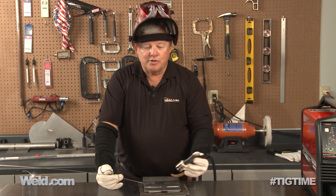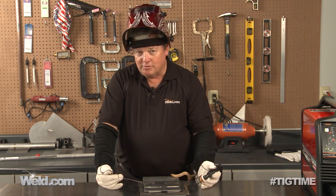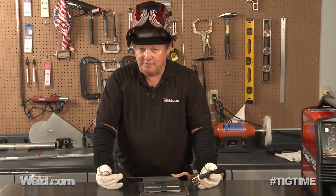What the narrower cleaning action allows you to do is get deeper penetration into the aluminum. This is just an exercise to show you how your machine can clean your aluminum for you. You don't necessarily have to do the cleaning action before welding, but I just want to show you the difference. We have several links in the description below showing different techniques and methods of welding aluminum, and we'll continue to add more. Anyway, let your machine do the work for you. If you have square wave, you have an advantage.